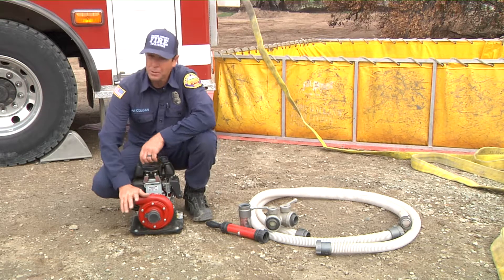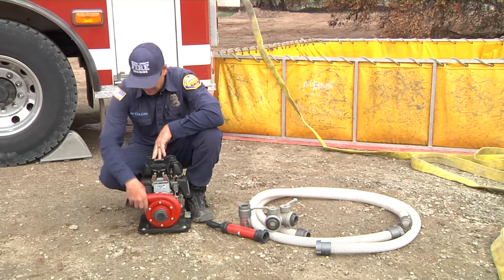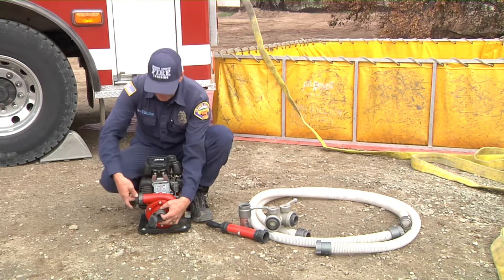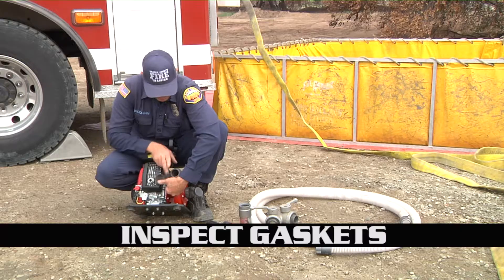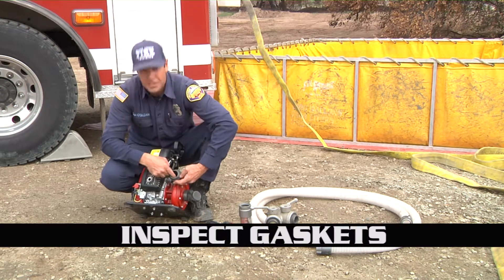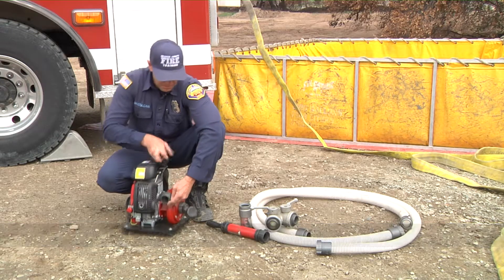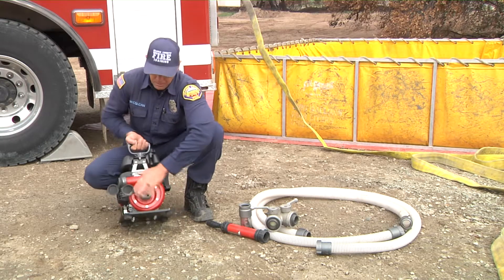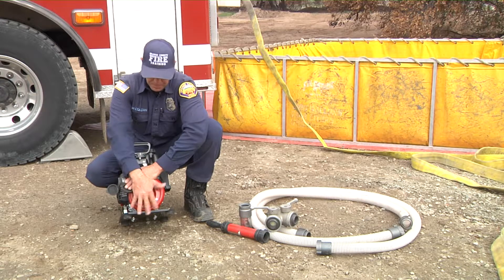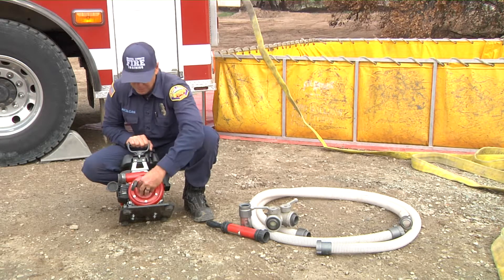This is the pump portion of it. There are important things we want to make sure we look at to make sure this works properly. On the adapters for the pump — on your intake and on your discharge side — these do have gaskets inside, in between the coupling and the actual volute of the pump itself. You want to make sure you look inside here and make sure they're not poking through and are seated properly, because air is not our friend coming into this pump. You will not get the performance you want out of this unit.